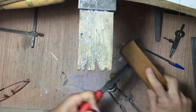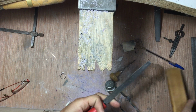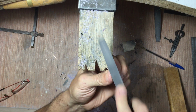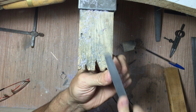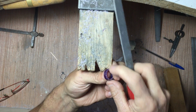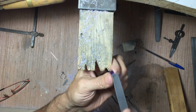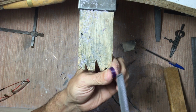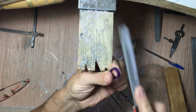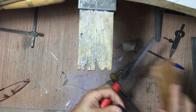And we'll just clean the file. Now, because I'm not using a wax file or a really rough file, I do have to clean it with a file card a little bit more often, but I think in the grand scheme of things that it really is worth it for overall strength. You can see how the ring's indents are starting to show up here on the side. And those are from melting the shank or the ring right into the wax. This is traditionally how we make fitted wedding bands.